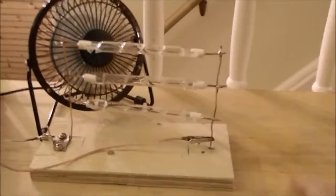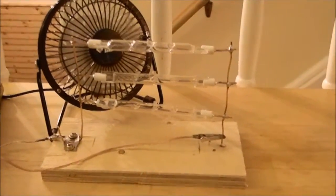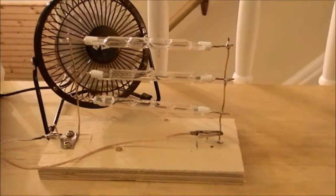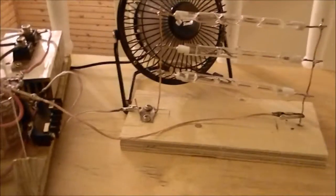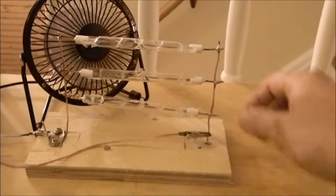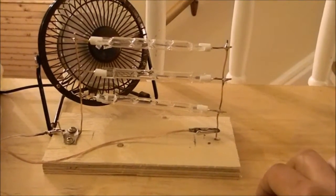I had four of these lights that are 500 watt halogens, and I have them in parallel. One of them broke when I was building this thing, so I only have three right now. When I dial this up to 130 volts, this thing should be drawing 1500 watts. I have this little fan hooked up here just because I have this soldered on right now — I think it might get so hot that the solder will melt, so hopefully the fan will fix that.